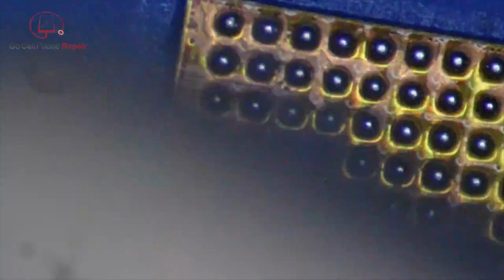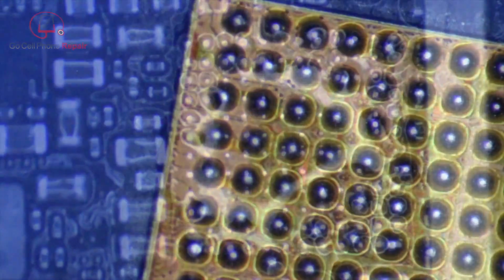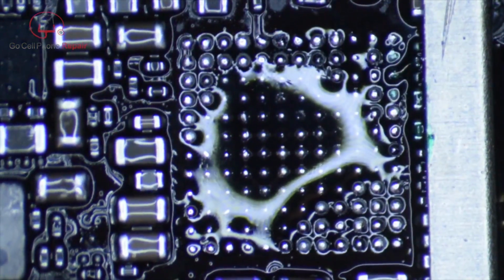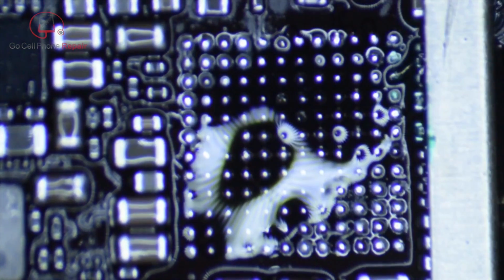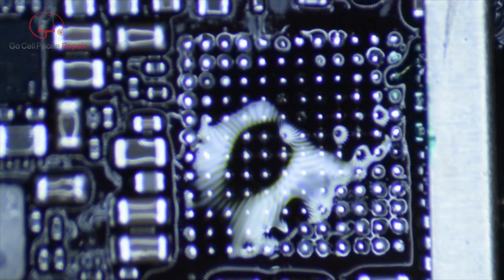I mean, it would take an entire video for me to really describe this process in detail, and I'll probably end up doing that later on. But for now, I just wanted to demonstrate the removal, running the jumper, and then reinstalling the IC. And yes, the audio IC is typically not damaged unless something happened, or the phone's got severe physical damage, or you broke it in the process of taking it off. So you should be able to reuse this.